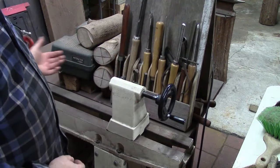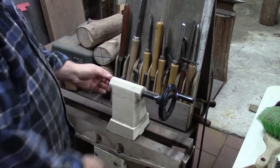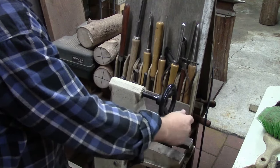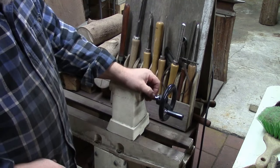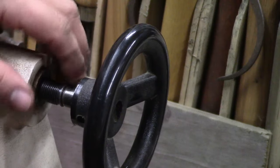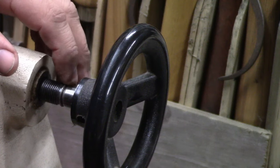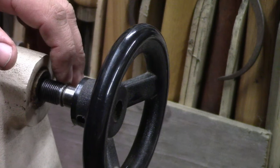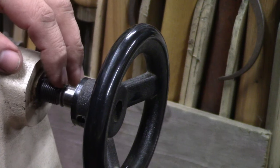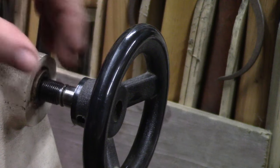The other day I had a block of wood between here, and I was twisting on this and smashing it up. It was spinning on me a little bit, so I wanted to get it tighter, and I turned it and I felt it give way. I didn't know what held that in there, but I felt it break. What is gone here is a little groove right here, right where my finger is, and that holds an E-clip. Some people call them C-clips, E-clips.